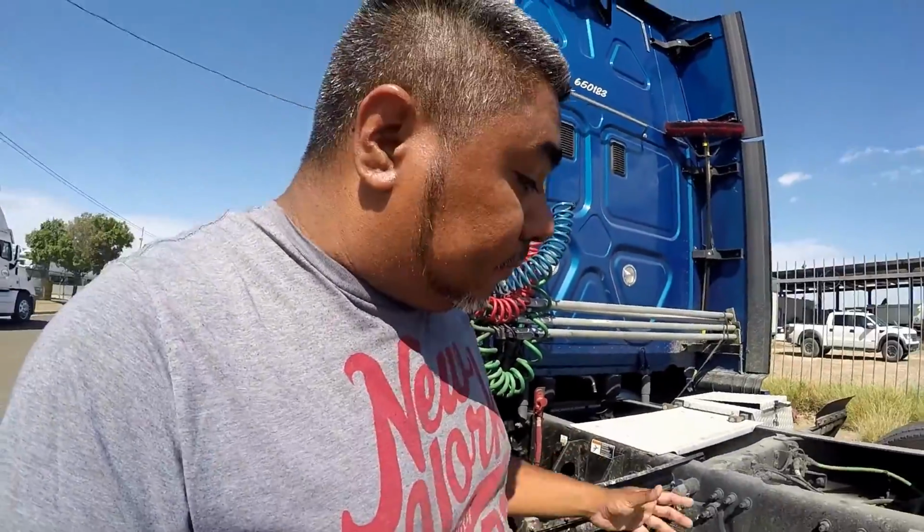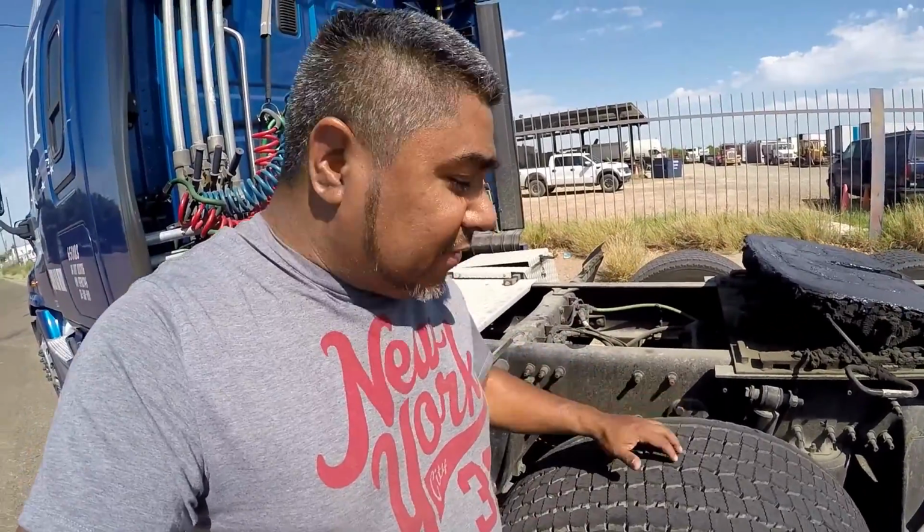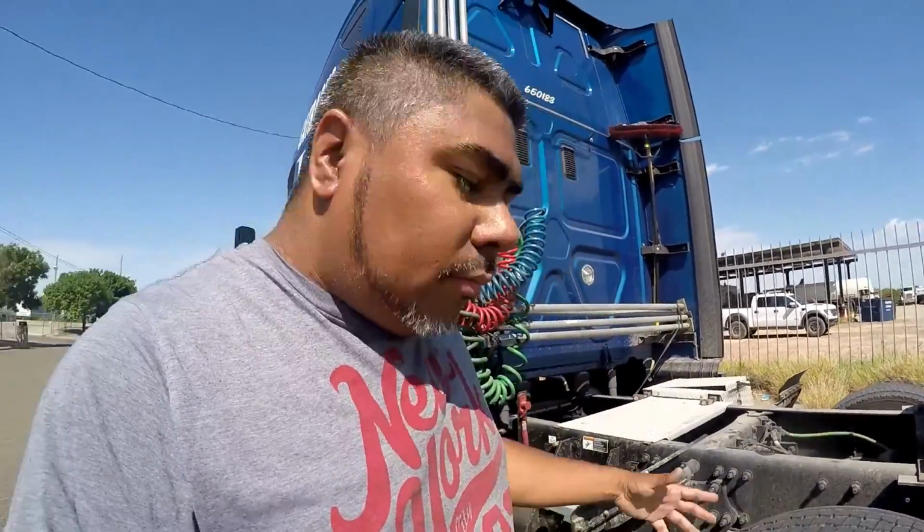All right, so let's do it again. Drive tire, when you say there's no abrasion, bulges, cuts, make sure you touch all 3 sides, not all 3 tires, all 3 sides, as you talk about it. So drive tire, make sure there's no abrasion, bulges, or cuts to either the tread or the sidewalls of the tire. Make sure it has no less than 2/32 of an inch of tread on it. And make sure that it's filled to the factory specifications. The air's filled to the factory specs, and I would use an air gauge to check that.